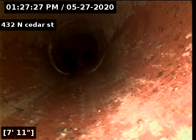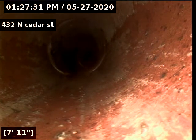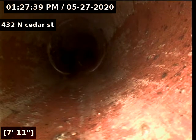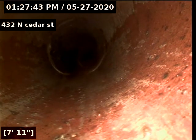I recommend the proper 4-inch two-way cleanouts be installed for future preventative maintenance cleaning or future issues, due to the length of the sewer line being 140 feet long. The line could be hydrojetted and scrubbed or snaked from that point. Continue to pull back.